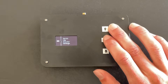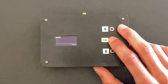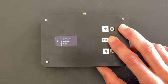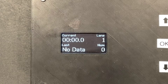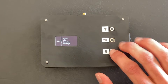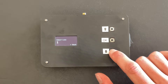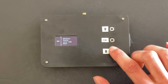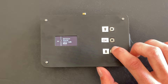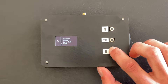For both Sprint and Lap mode, there are two options before going into the selected mode. The first is automatic mode, which plays a ready tone, then a set tone, and then finally a start tone. The tones have a randomized delay, making it good for practicing starts. The other option is manual mode, which plays a tone when the OK button is pressed. Counter mode only has manual mode, as it is meant for a coach or other person to operate. The final option is settings, where there are three customizable settings: distance, which lets you choose which lane to detect; speaker enable/disable, useful for coaches who want to call out the start themselves; and a calibration option that calibrates the sensor to ambient light and ignores background objects present at calibration.